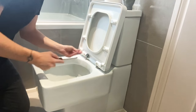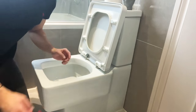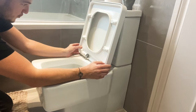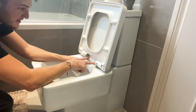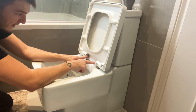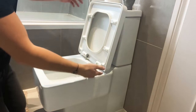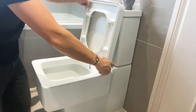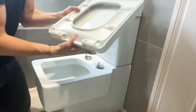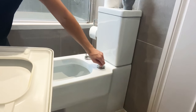Do the same on the other side — get that out like so. What we're left with is a more loose toilet lid and seat. These metal things in here are actually buttons, so when I push those in, listen carefully — you should hear a click — and then the whole unit should just lift up without issue. Click in again, lift up, and it comes off completely.